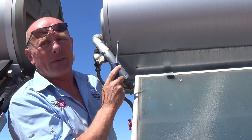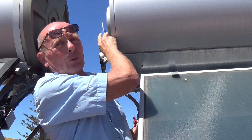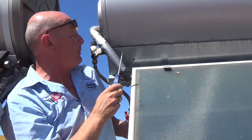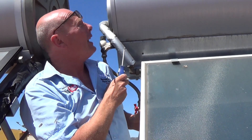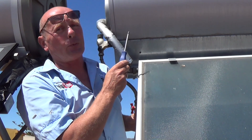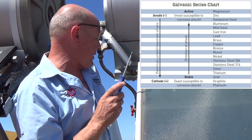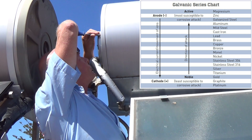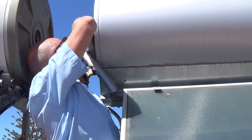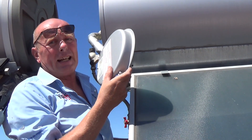Different manufacturers' tanks will be slightly different. This tank has an inspection hatch on the left-hand side where the heater is normally fitted, and there is also an anode behind the plate. It's worth noting that if you have a solar system, you should change the glycol once every five years and inspect the anode — anodes stop electrolysis and corrosion in the tank and are worth replacing every couple of years. First we need to take this inspection cover off. If you have an electrical system fitted, make sure you disconnect the electricity from the solar water tank.